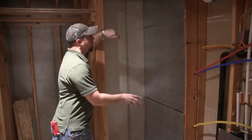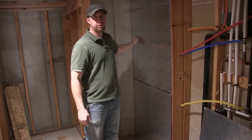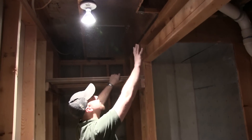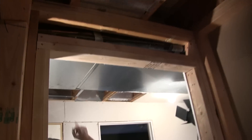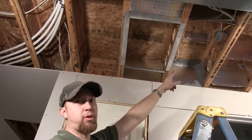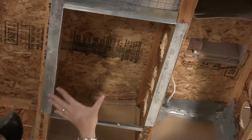To finish our return air, all we did was string this up so the ThermoPan wouldn't go anywhere. We sheeted it with the ThermoPan material 36 by 32, boxed it out, closed all this off, sealed it up, and then brought it into the TJI bays. We've blocked off the ends and ran down the bay over the top of the supply trunk line and into this area, where we drilled a few holes between the bays and went up into the top floor for a baseboard return air grill. Also right here there will be a return air grill on the ceiling.